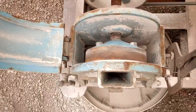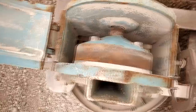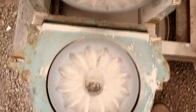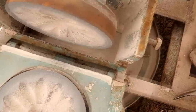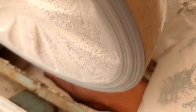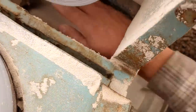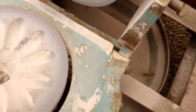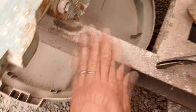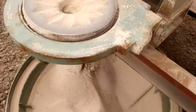A lot of you may be asking why I'm using this old piece of junk when I've got fancy hammer mills and shaker tables. The reason is I can get this thing 100% clean with no contamination between samples. When you're running small batches of maybe 10–15 pounds, you want to make sure there's no contamination between samples, especially when some of them are really rich like the specimen bags we have here.